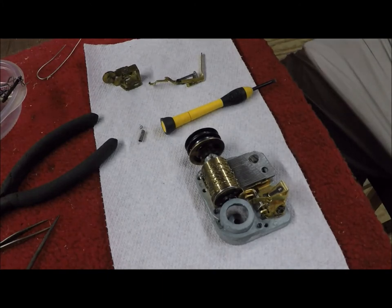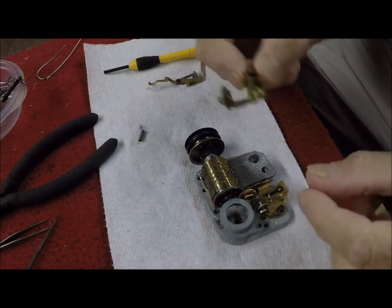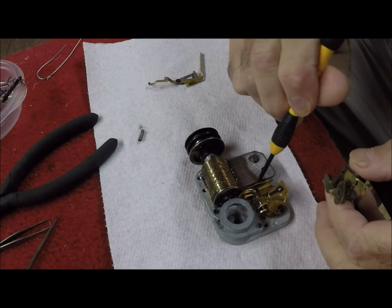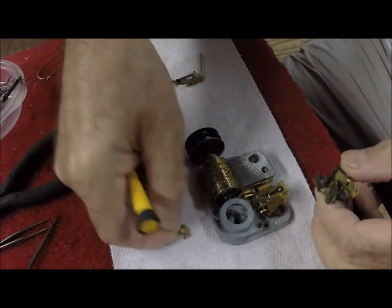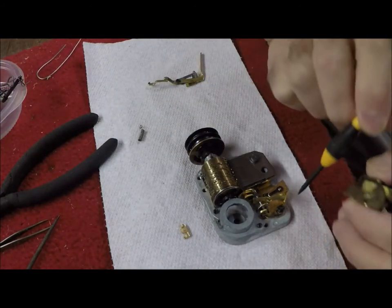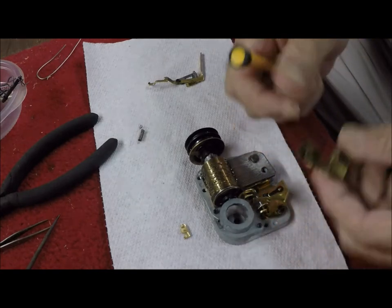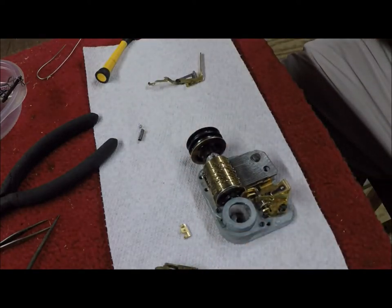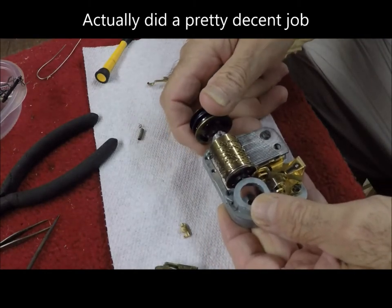All right, just to recap this, I had bought this governor and modified it to fit in here, cutting off this extra piece over here that I dremeled off, and then I slotted the screw holes out similar to this original one so I could move it back and forth. And I just put it in an ultrasonic cleaner that I just bought. I went and bought one at Harbor Freight specifically for this clock and another one.